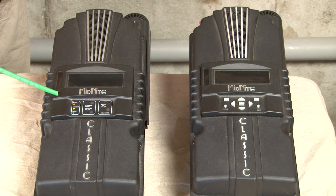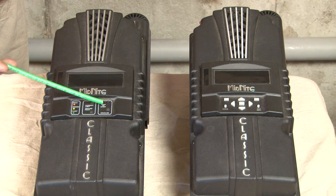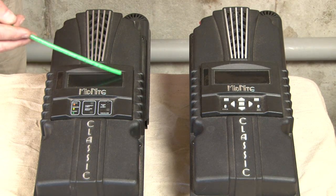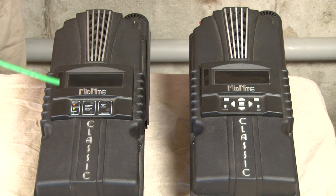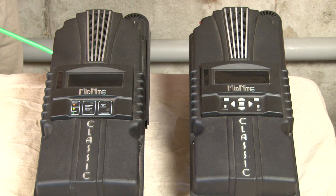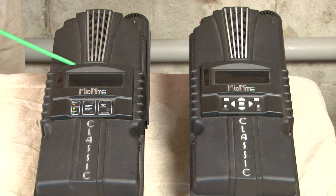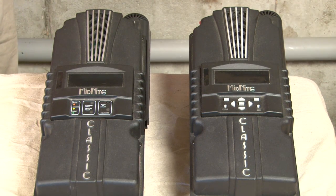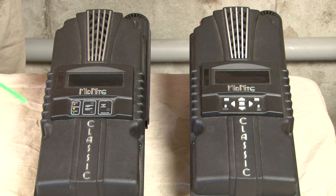The MNLP has LED indicators of charge stage, LED indicators for errors, and an LED indicator of equalize as well as a manual equalization button. It does not have a graphics panel, so there are no visual indications other than the LEDs. It does have dip switches inside to program the basic functions for a solar controller, as well as program equalization and the IP address so that you can use the functions of this over the local application software. If you want to use this on a wind turbine you do have to use the local application software to do all the programming.